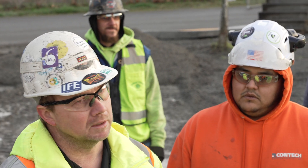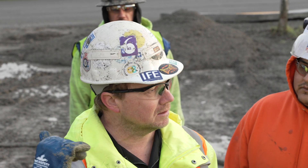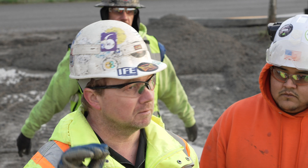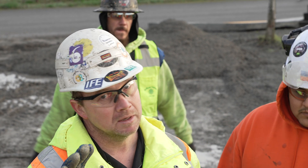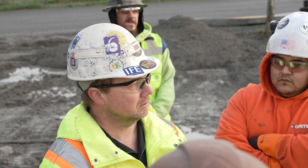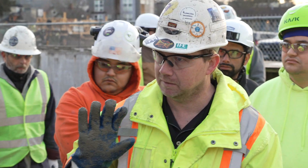Pervious is a little different. If you over water it — like on my regular mix, I'm going to say I want to bring it up a slump, give me 10. On pervious, this is just my personal thing that I like to do: I'll give them five at a time and check it. Because if I over water the face, now I can't go back. So always be careful with your pervious — give them five at a time.